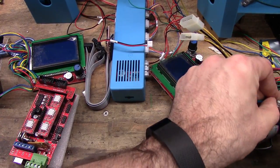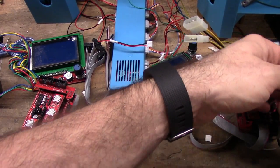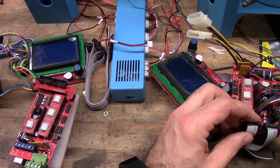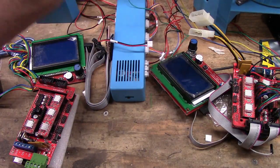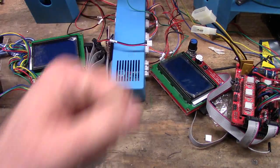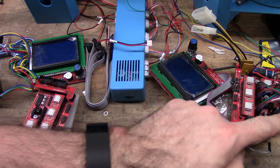Though I'm not complaining about my bundle of wires. But more solutions. He also has a full upgrade to the 101 Hero to the same as what I have, fully upgraded, all new steppers and extruder, except he used NEMA 17. I used NEMA 14 because I was trying to get it to match up to the pre-existing holes. It just didn't work. Okay, so that's steppers, sensors.